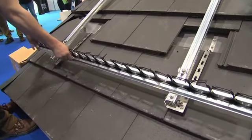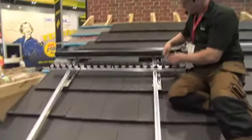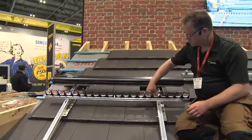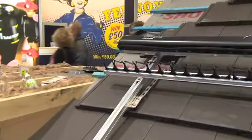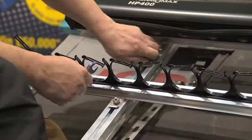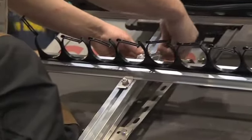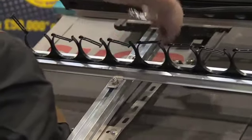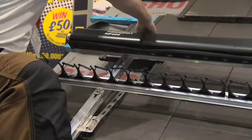How many tubes do you typically need for a house? Again, it comes back to sizing, because we've got an easy way of doing it. We can say 1 tube equals 10 litres of domestic hot water. If you go through Water Regs or G3, it will look at between 40 to 60 litres per person per day as the average annual usage. So 5 tubes would do 50 litres of water, which would probably cover 1 person. But then it comes to the size of the cylinders, because you'll have a primary heat source as well. So we can work it out that way: 50 litres per person per day, 10 litres of hot water per tube, which makes it a nice rule of thumb, easy sizing.